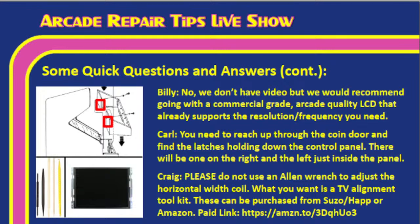Yep. So, Craig, please do not use an Allen wrench. I know Craig said plastic tool, Tim. Right. So I'm going to give Craig credit, but we do want to remind people, do not use an Allen wrench to adjust the horizontal width coil. Very bad idea. What you want is a TV alignment toolkit, and these can be purchased from Suzo Hap, suzohap.com, or Amazon. And Tim, we have an affiliate link here for Amazon. You can go down in the show notes below and click that link. Or Tim just mentioned the realbobroberts.net also probably still has them as well. So TV alignment tools, what you're looking for, Craig, get one from the link below or at any of your favorite arcade parts suppliers. Okay, Tim, did we do it all?